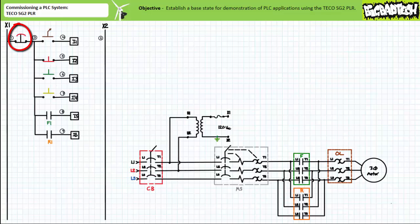but rather serves as a hardwired bottleneck through which all six field input devices immediately downstream of it must negotiate to issue input to the PLC. Wired in this fashion, the hardwired e-stop effectively severs all incoming communication with the outside world without the necessity of resorting to any programmed instructions to do so.